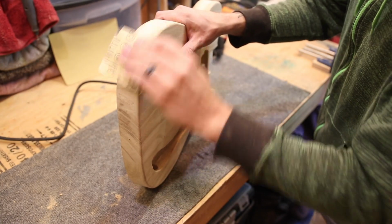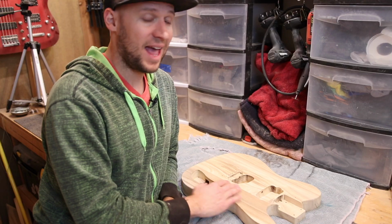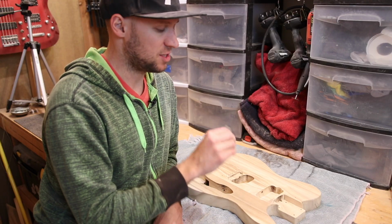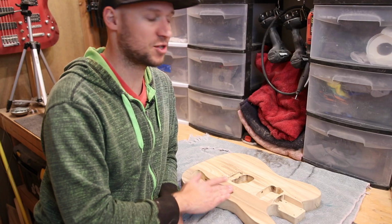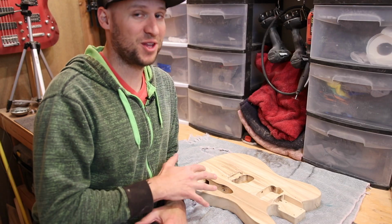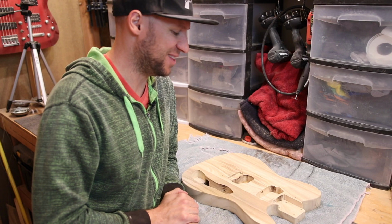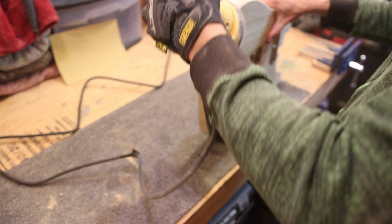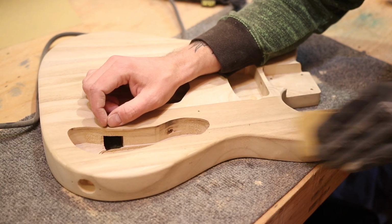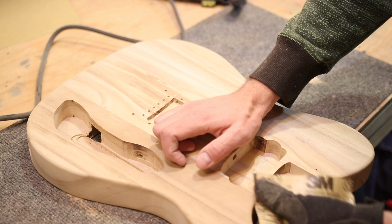The reason why is because when we start filling in this grain, any minor nicks and dents and scratches, our filler is gonna pick up and think is wood grain, and it's going to exaggerate those. You guys all know how much I love sanding. No, don't like that. So this is gonna be quite the feat. I'm gonna try to hack this the best I can using an orbital sander and only hand sanding in the very tight, hard to reach areas that the orbital can't get to.